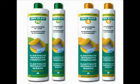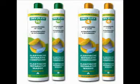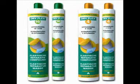Dry Flex 16 has a working time of up to 2 hours and Dry Flex 4 has a working time of up to 25 minutes. However, good practice is to mix and use well within these times. The curing times depend on ambient temperature and size of repair. As a guide, Dry Flex 16 will cure in 16 hours at 20 degrees centigrade and is suitable for large repairs. Dry Flex 4 will cure in 4 hours at 20 degrees centigrade and is also suitable for low temperature applications.